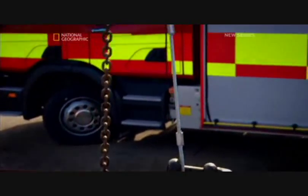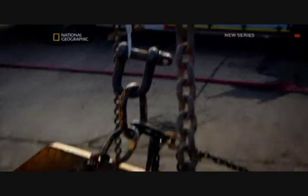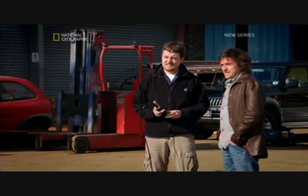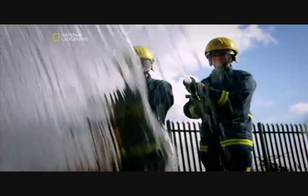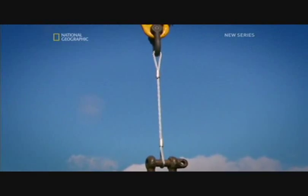To prove Wilhelm Albert was on to something, we tested cable. No surprise — we quickly got the skip to overflowing. The cable, although the same diameter as the chain, is easily carrying over 800 kilos more, and well over 4,000 kilos more than the rope. It's the best of both worlds. Twisting metal strands together like rope means cable is exceptionally strong, and when it fails, it should give ample warning, just like rope.